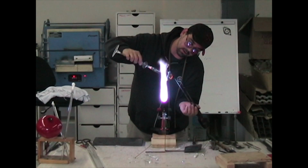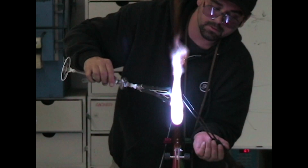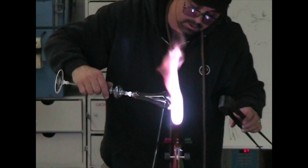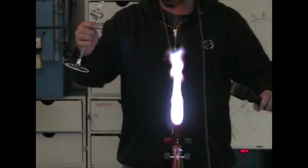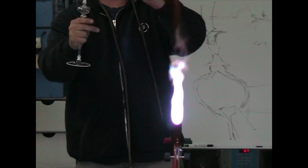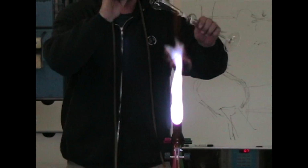It's a general lifting motion. And I'm only going to lift it out a little bit. Now with both blades. Now, paddle that lip flat a little bit. Okay. That's my setup for the lip ring. It's a decent setup. Having that bubble come back out and having the abrupt shoulder shape there gives me a base shape for heat to flare it out, and also a good base shape to put the lip wrap on.